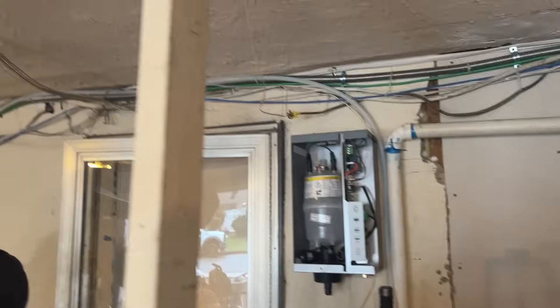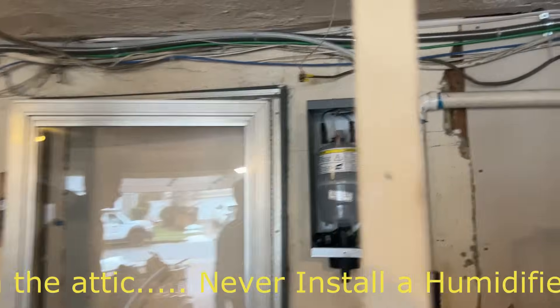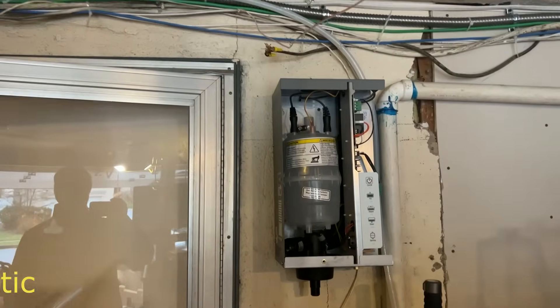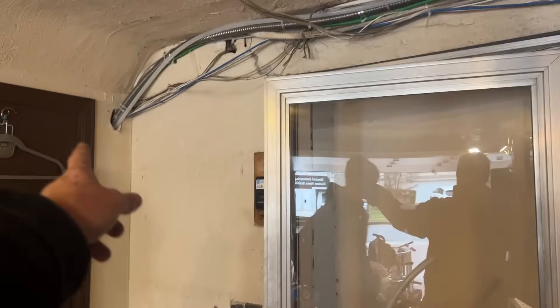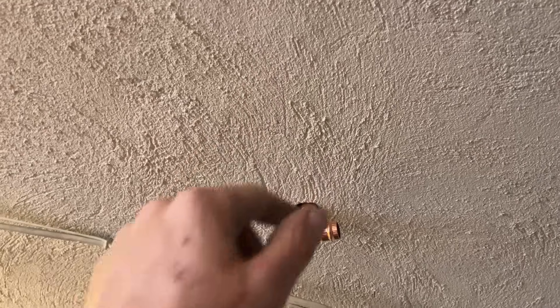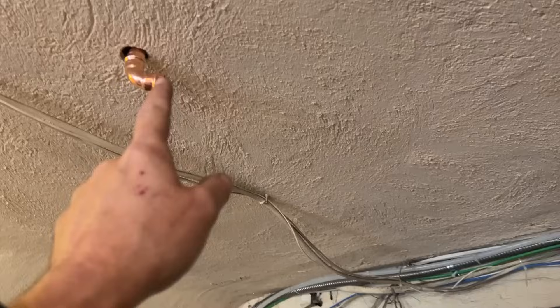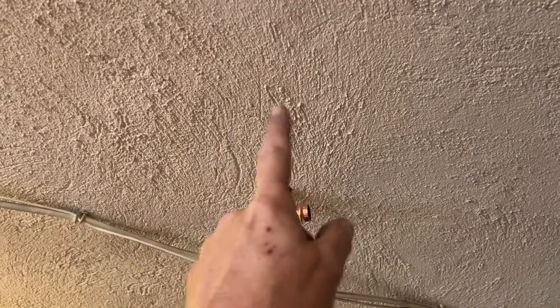Watch this. Here is the garage — is it conditioned space? The answer is no. It's insulated, but it's not heated. Here is the Aprilaire 800 steam humidifier. We just ran half-inch expansion PEX from the boiler room on the other side of the house to here. We have a hole right here in the ceiling, which goes through the closet above us and then into the attic. We're going to run one-inch radiator hose from the steam humidifier here across the ceiling, up the inside wall of the closet, and into the air handler return plenum.